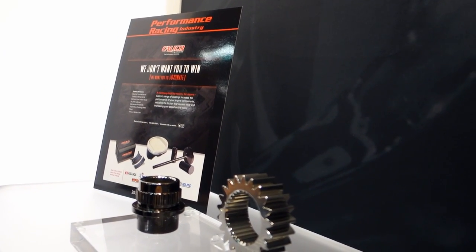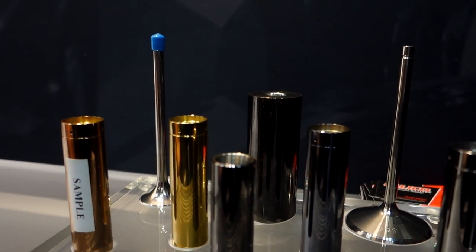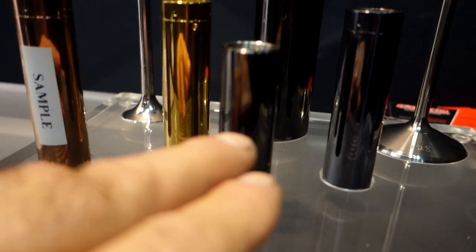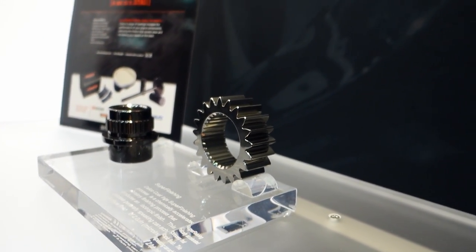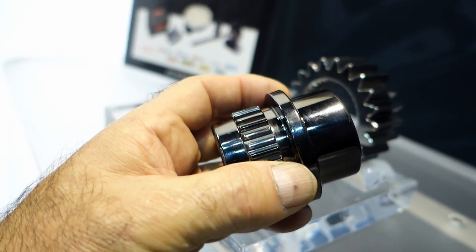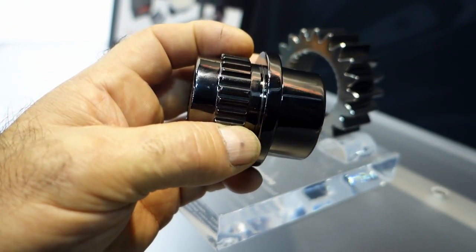Yes. And then we're going to put this coating on here, which is the DLC coating. Which you said the hardness goes to how much in Vickers? It can go up to 2,400 Vickers. So the process is that we have to do this here after we do that over there. Okay, got it. That's the process. A lower coefficient of friction with this part, and then we can run lighter weight oils, which will also help produce more horsepower to the rear wheels. And you'll get less parasitic load on the drive line.